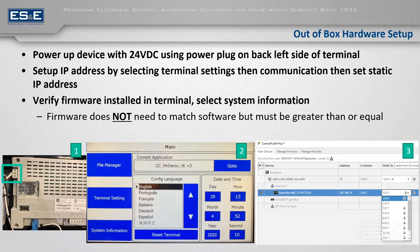You will also want to verify the firmware installed on the terminal — you can do that by selecting terminal information. With Connected Components, your firmware does not necessarily have to match the software revision. This is different from the rest of the Allen Bradley suite of HMIs and controllers, where you typically have to pair them from software to firmware.